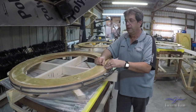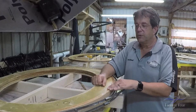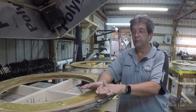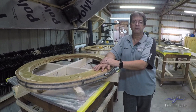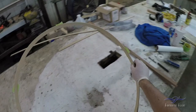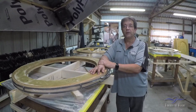All of these are done cold — no steaming or soaking to wet them down. We often forget things in engineering that guys figured out long ago, so it's a good idea to follow the original design information. The drawing showed one-eighth inch thick laminations on this one. You might think you could use something thicker, but Callan did some experimentation and found this requires an eighth of an inch maximum if you're going to bend the spruce around here without cracking. Go any thicker and it'll crack before you can bend it snug. Those original designers were pretty sharp.